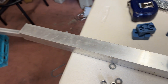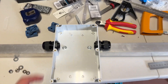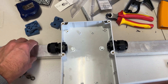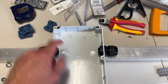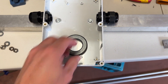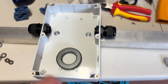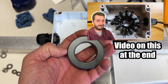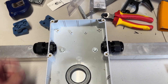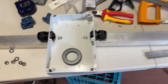I also need one on the other side — I need a slightly bigger garage, but I'm going to have to move outside once I put these elements in. I've mounted this weatherproof box, which I've bolted to the aluminum tubing. I've got an FT240 toroid that's going to sit in the bottom of the box, and I'm going to have a cable gland with some RG58 coming through, wrapped around the toroid for common mode current suppression. That's then going to connect onto the two legs of the dipole.